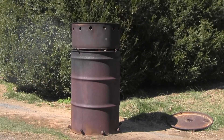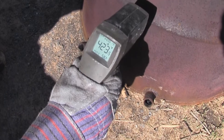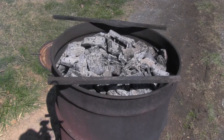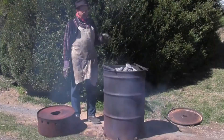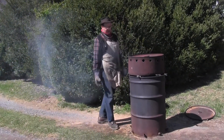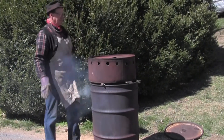It's about 12:30 — I think we started at about 11. See where it's turning black? That's where the flame front is; that's where the rust is turning to magnetite. It has not reached any of the vents yet — this is charcoaled, that's over 500 degrees. With the lid off, we're getting a little more smoke, and this is all burning to ash because it's being exposed to air blowing over the top. Whereas when we put the lid on, air is sucked in here and burns the gases coming out here, so that convection is protecting the surface from burning all the way to ash.